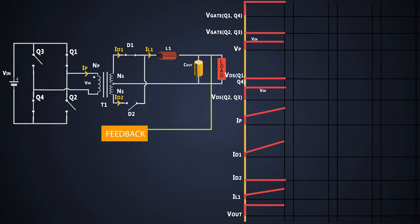Now we cannot turn on the MOSFETs Q2 and Q3 immediately, because transformers are nothing but inductors. When they are connected to a power source, they store energy, and this energy has to be released after each cycle, or else the transformer will get saturated. If a transformer saturates, it suddenly acts as a very low resistance component, which creates a short circuit. Hence, to avoid that, the transformer has to reset after each cycle.